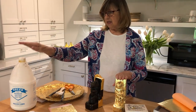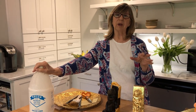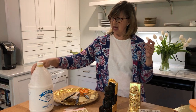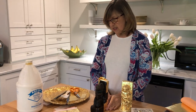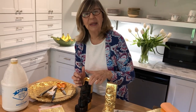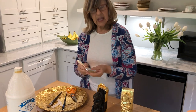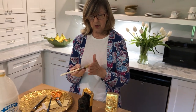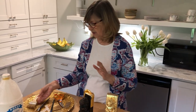I have already applied sizing. We're not doing water gilding today — water gilding uses an adhesive made from gelatin. Today we're doing an aqua size. Sizing means glue, and the trick — I can't stress this enough — is a very thin layer of glue. Otherwise it gets clumpy and the gold gets stuck in there. I use a very inexpensive brush; for something smoother, use a nice soft bristle brush.